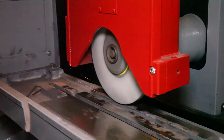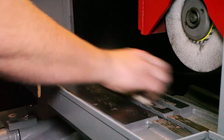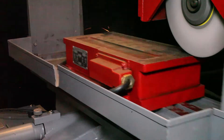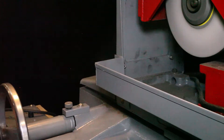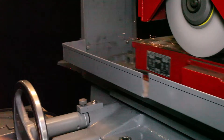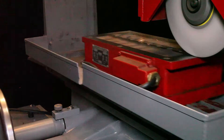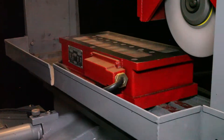That's quite a workout when you don't have a hydraulic cross slide. Now I'm using a machinist stone to remove any burrs, and we set the chuck on upside down. You can imagine how we held it down — we simply turned on the magnet and the chuck held fast to the bed. Now we're machining down the bottom of the chuck dead flat. Mostly doing woodworking these days, so this is basically the metal equivalent of jointing and planing a piece of wood. We established a flat surface on the bed, then we'll establish a flat surface on one side and use that to tram in the top of the chuck.